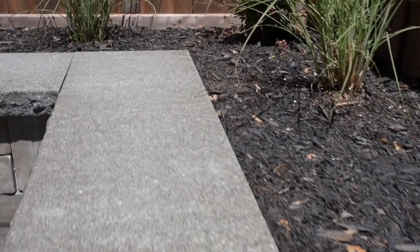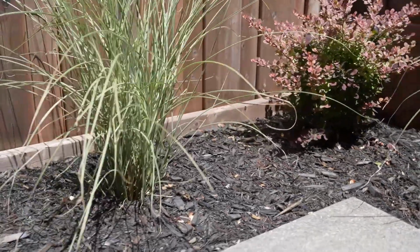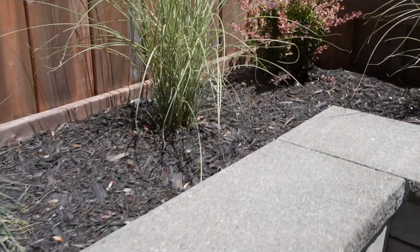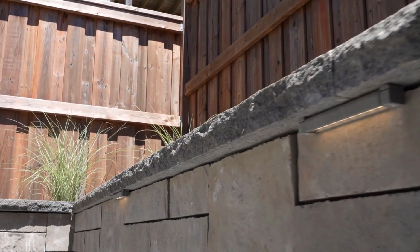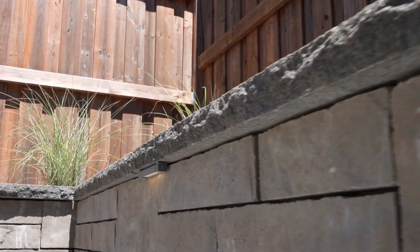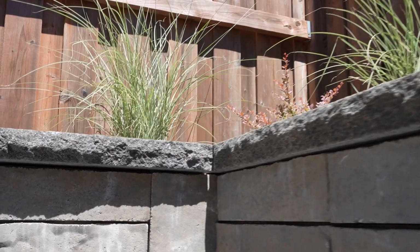Another opportunity to do a miter would be on an inside corner where two caps are meeting and one has a rock face. It doesn't quite make sense to shave off that rock face in that small little area where the caps will meet and slide it over. It makes more sense to miter those corners on an inside corner to allow those to fit nicely.